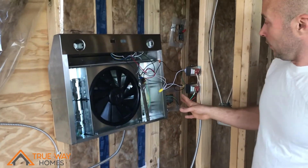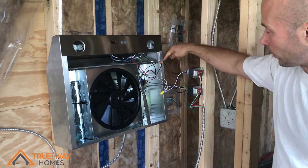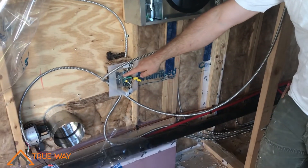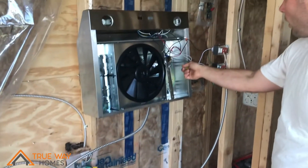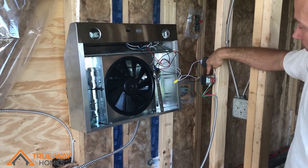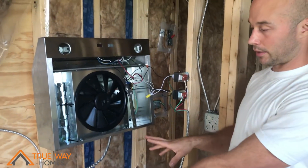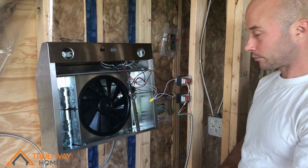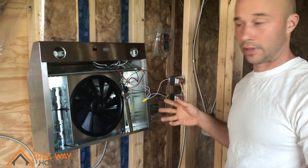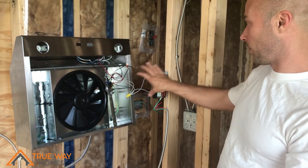When I came into the housing of the range hood, I split off and went to one transformer with a hot wire that has power, and that wire goes down and connects there. Then I have another wire that comes off the toggle switch so that if it's on high or low, power comes over, transfers into 24 volts, and goes down to the damper. Those are the two hot leads that tell the damper when to open and close. If you want more detail on the exact wiring and placement, leave me a comment and I'll be happy to answer those questions. That's pretty much how the flow works.